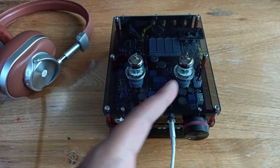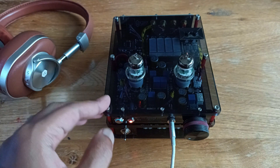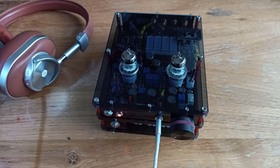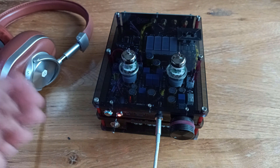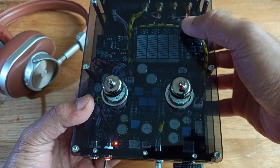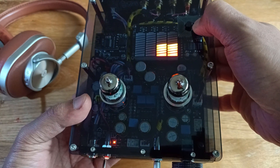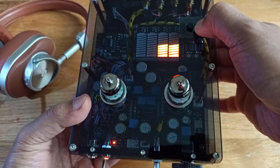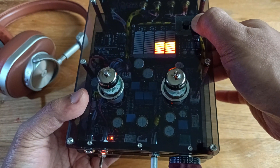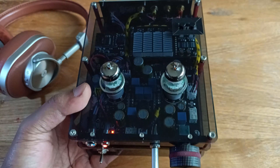You can change the valves and the op amp, and the best thing about this is it's battery operated — about 8 hours run time using salvaged lithium batteries. To keep an eye on the batteries you can check them; it's been calibrated to show 4.2V maximum and 3V minimum. At the moment the batteries are at about 3.7V, which is the nominal voltage.